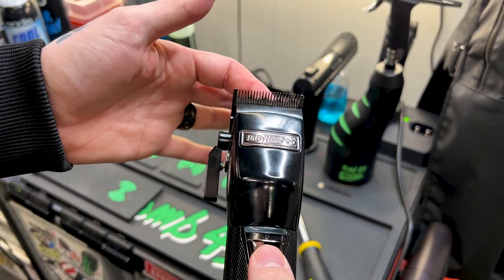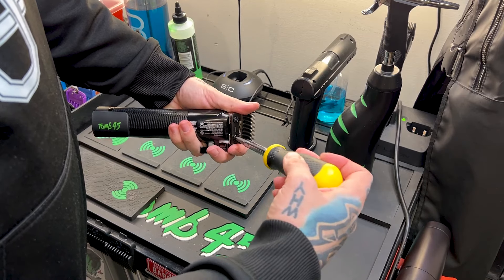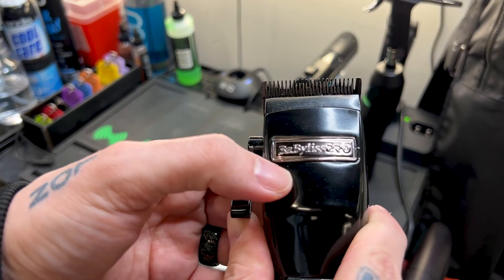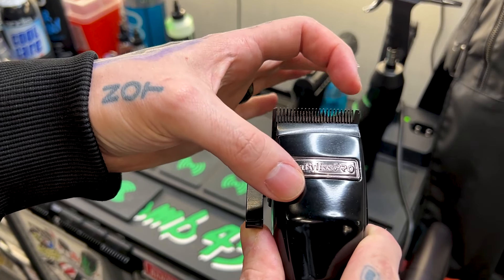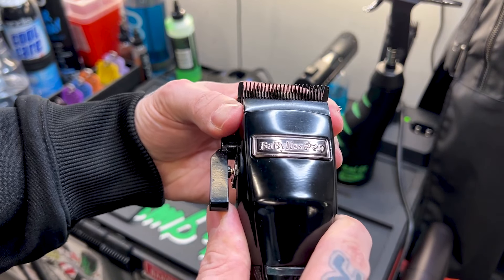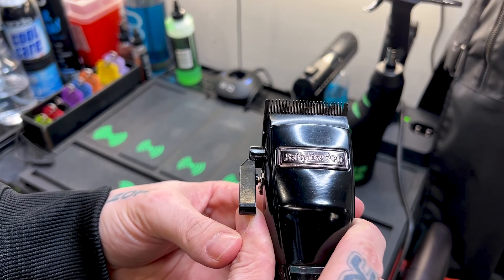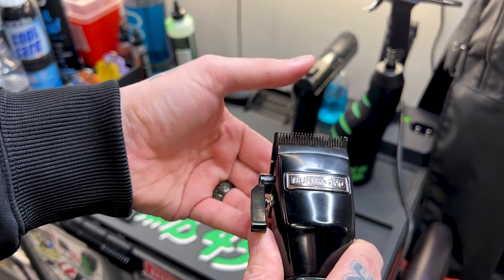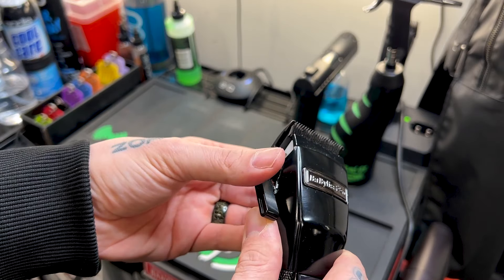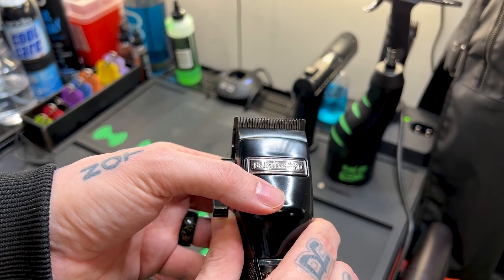You guys can see mine is actually a little bit further one way, so I'm going to loosen that up and move this back to center. You see we have our cutting blade in the middle — we can see a lot of teeth over here on the steel blade and it's coming too far over this way. So as I move that, we're going to put the steel blade perfectly centered behind the cutting teeth. I'm going to lightly press down to move it to where I want it, tighten that down, and we're going to call this done.